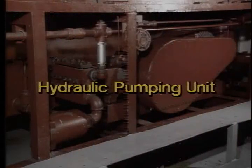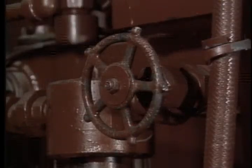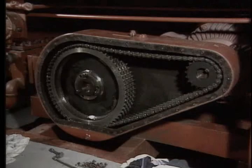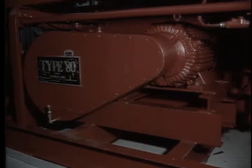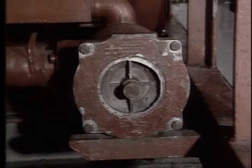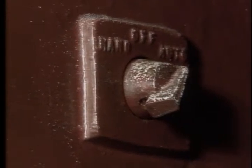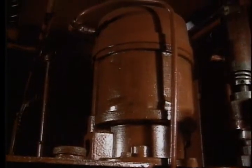Once the fluid leaves the reservoir and mixing system, it carries on to our second system within the system: the hydraulic pump unit. When we speak of the pump unit, we mean the entire pumping system with its valves, filters, motors, and hydraulic pumps. The electric motor drives the triplex hydraulic pump by a chain drive. The pump — or pumps, if your rig has two — charges the accumulators to system operating pressure. Fluid passes to the suction side of the triplex pump from the mixed fluid reservoir through a shutoff valve and suction strainer. On the discharge side, a check valve keeps the accumulator pressure from backing up into the pumps. The motor control box determines how the electric motor is controlled. The hydro-electric automatic pressure switch is capable of operating the motor automatically by sensing system pressure. The air-operated hydraulic pump is the backup to the triplex pump.